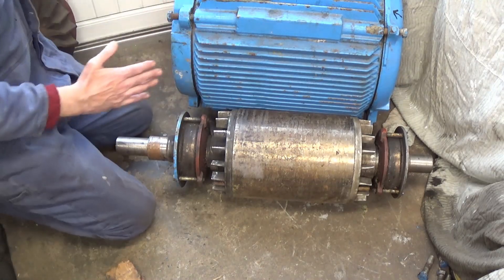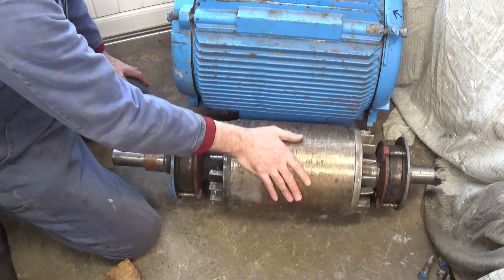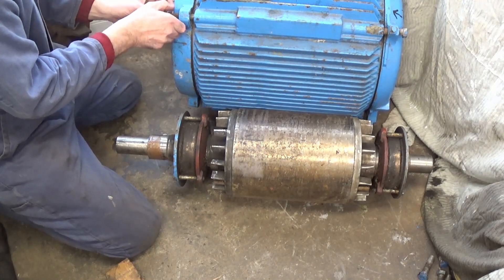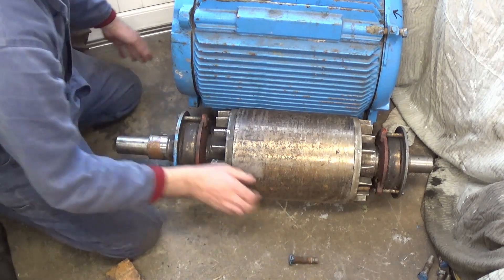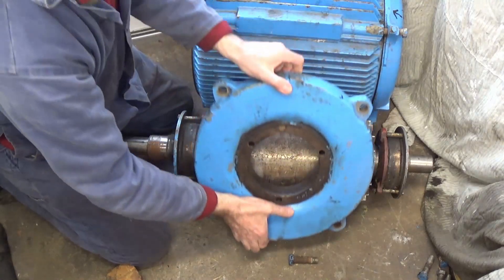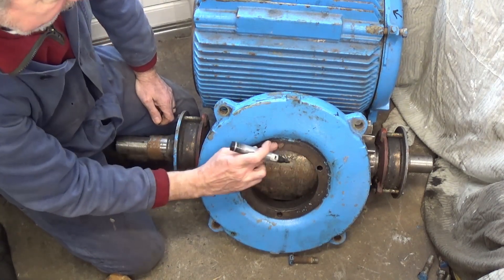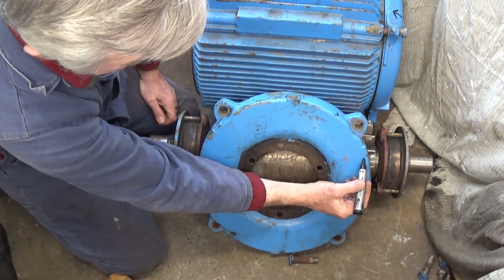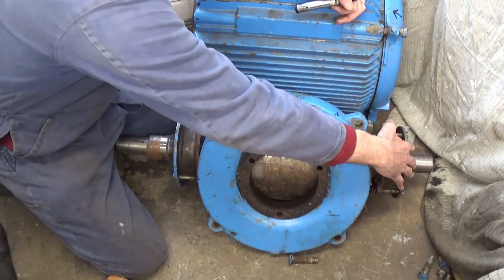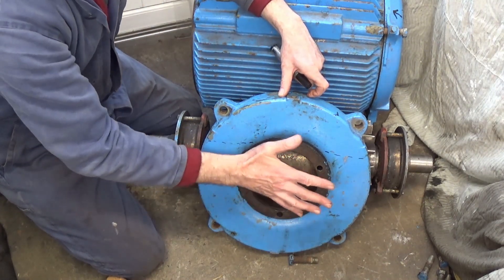The motor — what it's going into — I'm going to cut the top off so that the wheel on the bike can rest on this, and as you accelerate with the bike it's going to turn this rotor and speed it up, and that's where you get the resistance as it increases the inertia of the rotor. Now the end plate — the rotor comes to around about here inside — so I'm not going to cut the top off straight across, because these end plates hold the bearings for the rotor, and if I do that I'll only have two bolts at the bottom and it won't hold it steady.